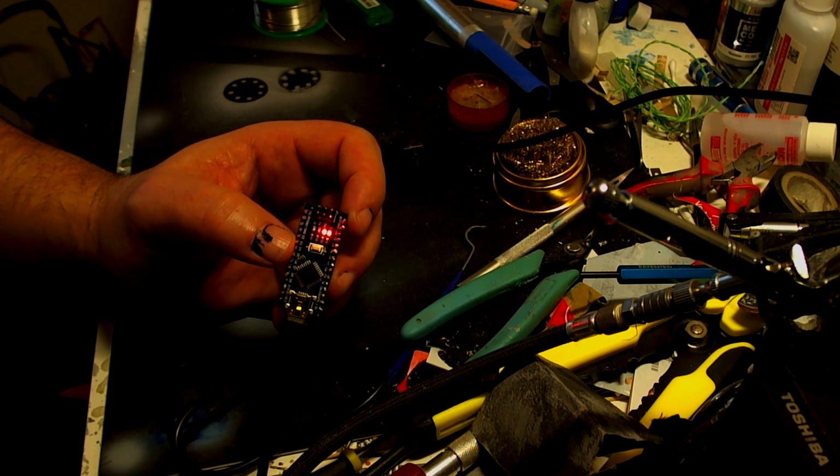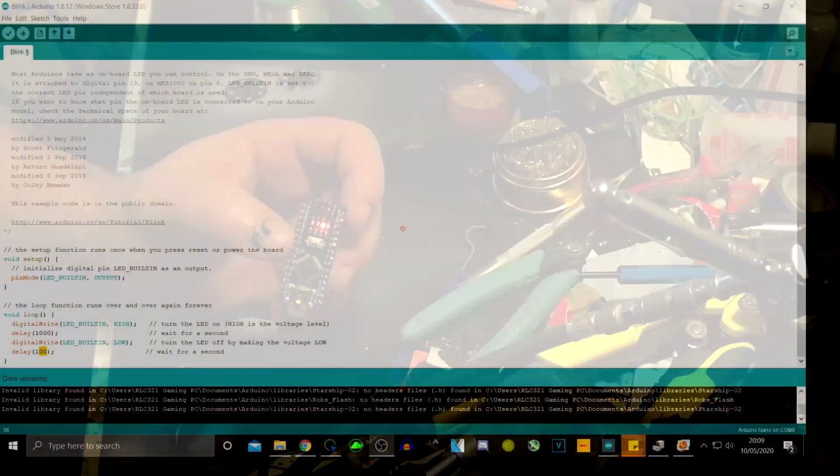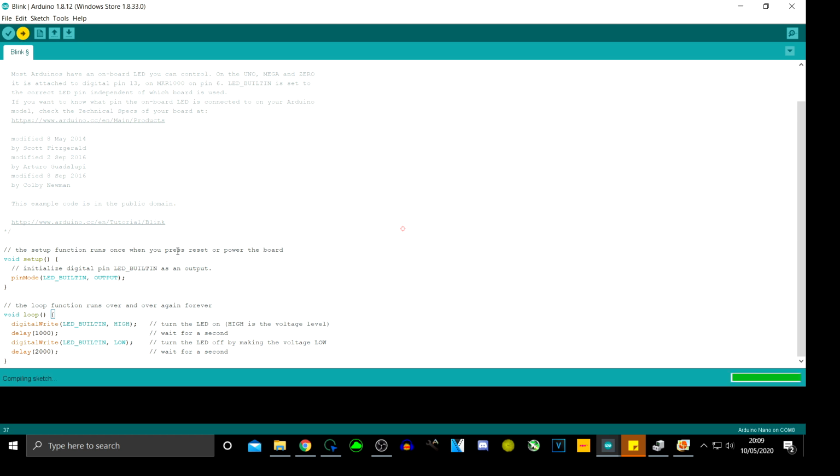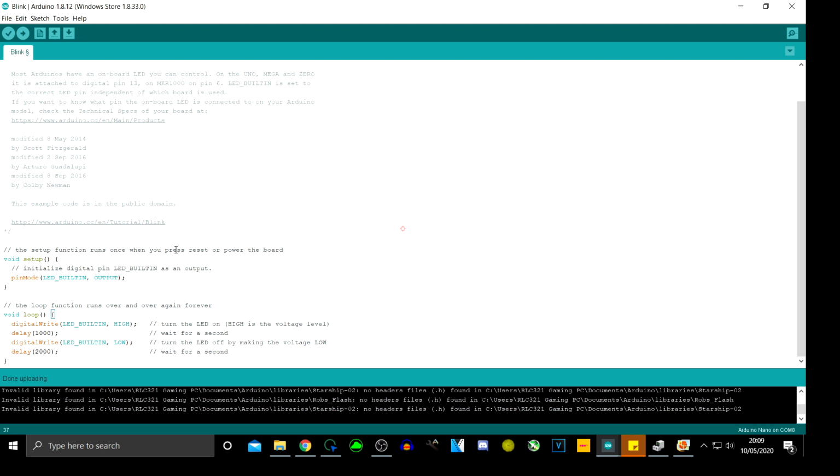So let's see if we can go a little bit further. Let's see if we can go this one. Let's go to there again, sorry. Go back into our program, change this to what, 2000, and keep the other one as 1000 and upload. Let's see what it does. And it's going to stay off for 2 seconds and stay on for 1 second, because each of these timings is 1 millisecond, I believe. So 1000 is 1 second, so 2000 is 2 seconds.